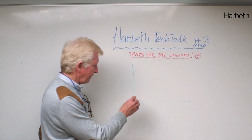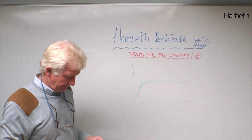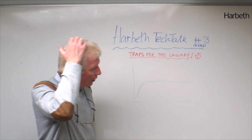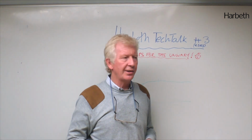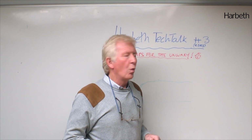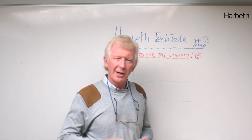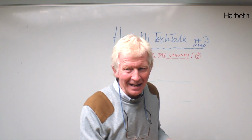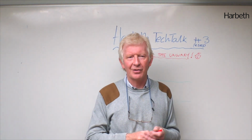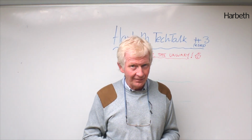And they found that if this was the frequency response of the audio system, and I asked you to draw a high Q or a low Q resonance on this graph as superimposed on top of the audio, what would be more objectionable? What would be more obvious? Would it be the low Q or the high Q? And I bet everybody, including me, I hasten to add, would probably say, well, of course the high Q resonance would be more obvious. It's got a defined pitch, it's loud and clear. Actually, the opposite is true.